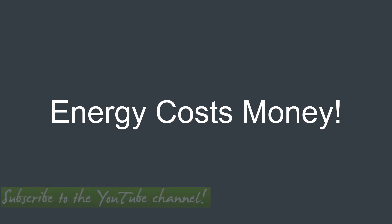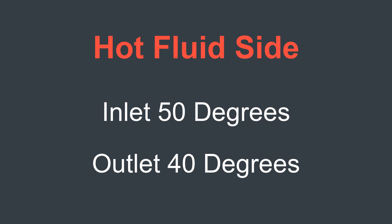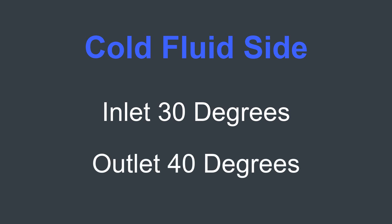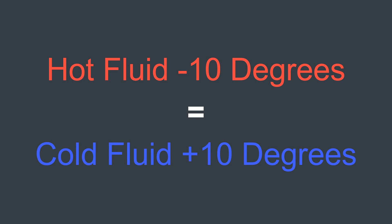And that's something we definitely don't want, because energy usually costs money. To understand how the plate heat exchanger works, let's imagine on the hot fluid side we've got fluid going in at 50 degrees — not specifying Celsius or Fahrenheit, use whatever units you're comfortable with — and it comes out at 40. Correspondingly, if we've got a 10-degree temperature drop, we're going to have roughly a 10-degree temperature gain on the cold fluid side. So if we go in at 30 and come out at 40 on the cold side, that's 10 degrees gained. These are rough approximations, but good enough for now.